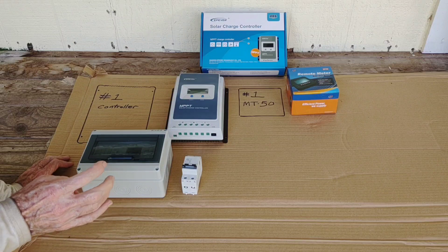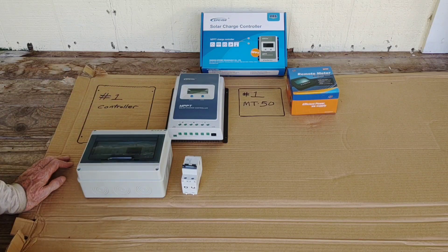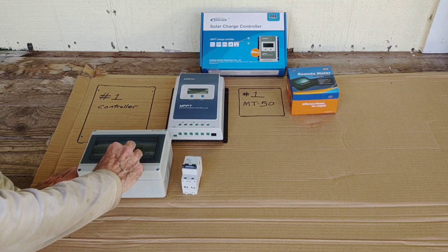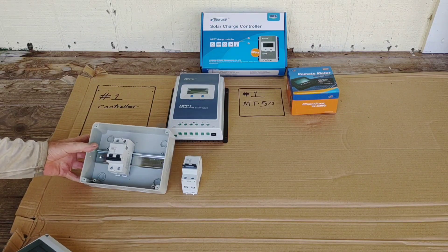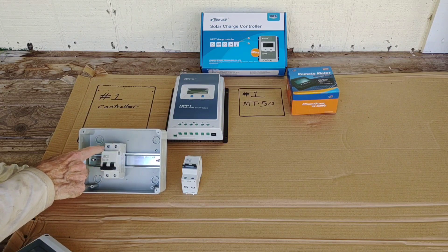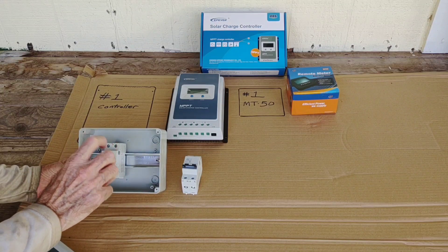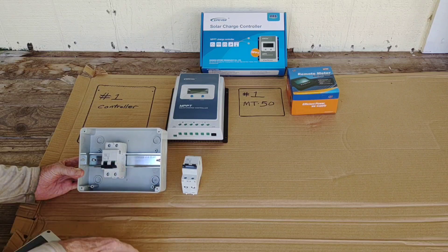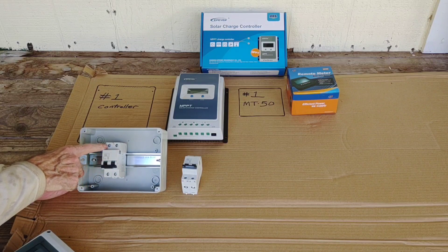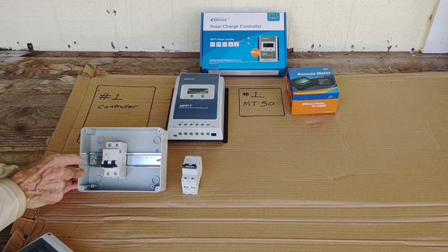One of the other things I'm going to do — I had a couple of shutoff switches I was going to use just to turn the panels off if I needed to disconnect them from the solar array and the charge controller. But what I decided to go with was one of these rail-type breakers — a positive and negative breaker — as opposed to some of those switches where you're only connecting up the hot line. I decided to go with the much safer and actually very easy to install rail breaker system.